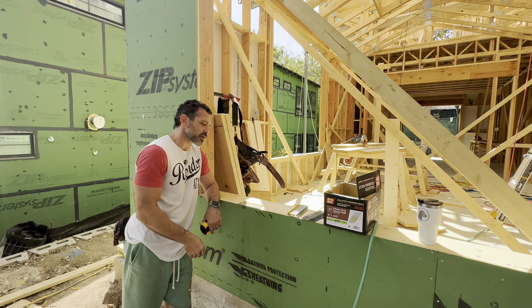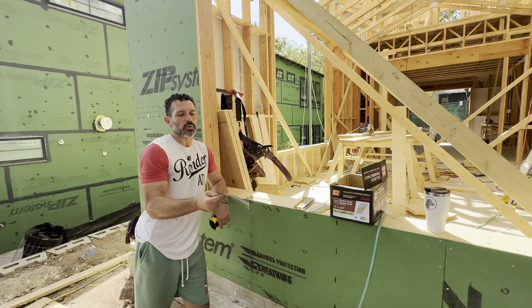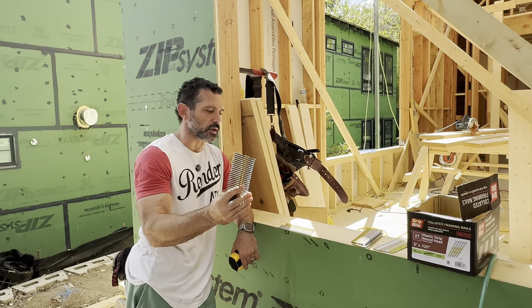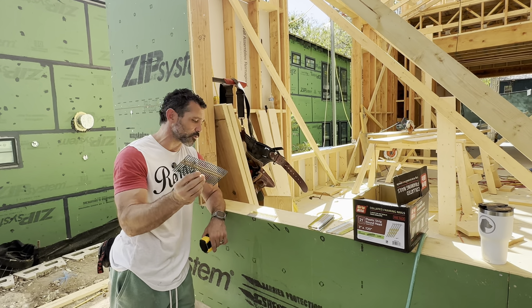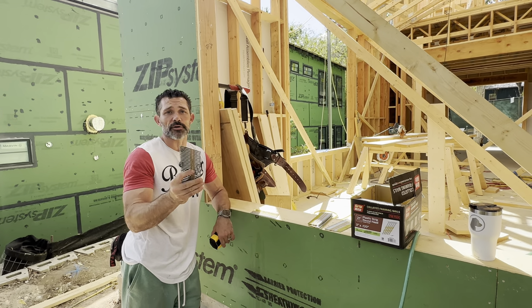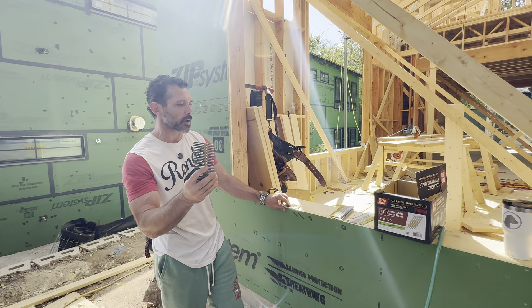That's how they sit through that one-inch Zip sheathing. This, for example, is a typical framing nail. This one is not hot galvanized, not screw shank or ring shank, and it's a little bit wider — it's a 0.131 width diameter, which is a little more like the old-school width that a framer would grab.